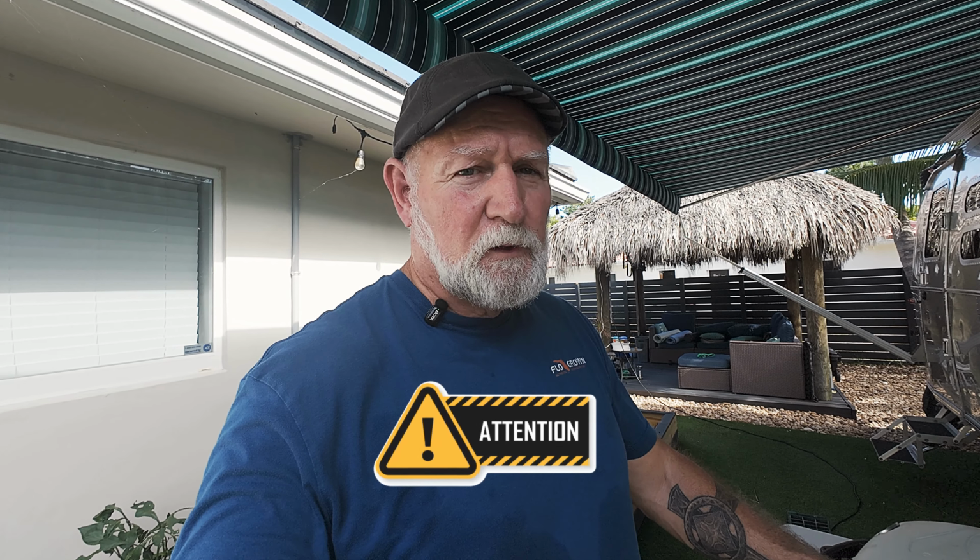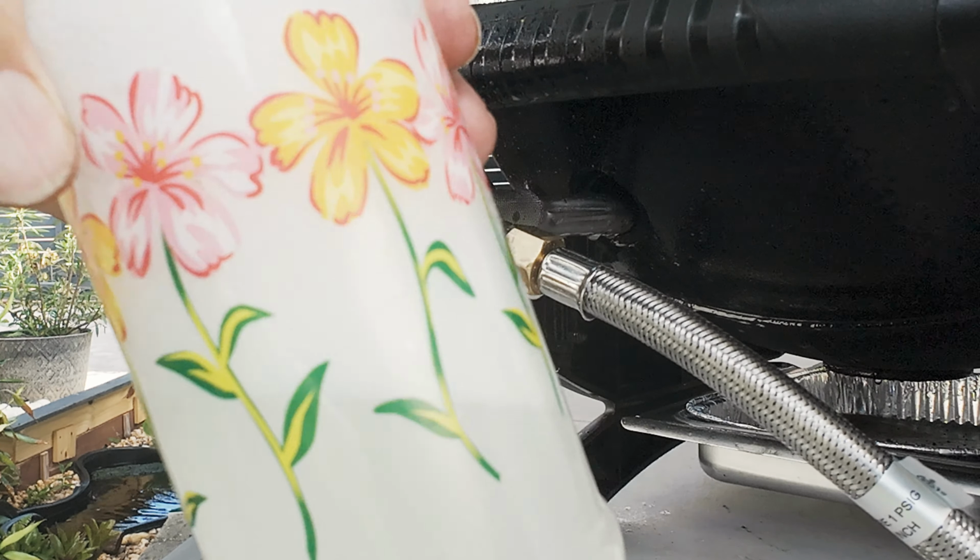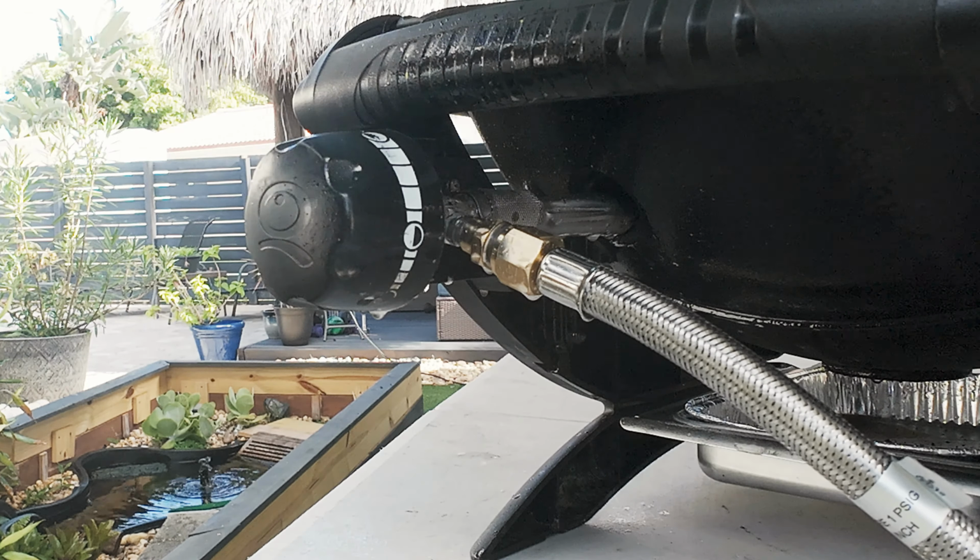Okay. As you can see, I do have a nice soapy solution in here. And one more good spritz. We do not have any leaks. I already checked, but I'm going to show you up here. Just make sure that there's none on any of these original fittings that came from the factory as well. We tested all of them as well. And we are, in fact, leak free.